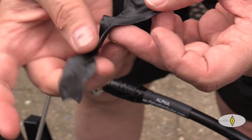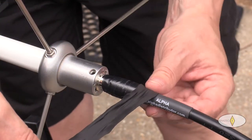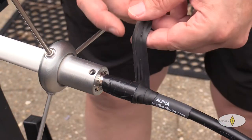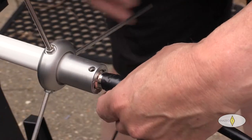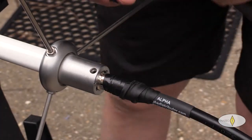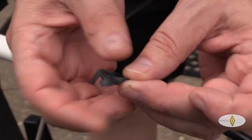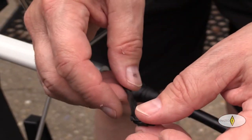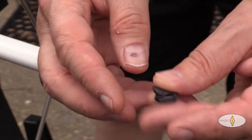Okay, now you want to start it at the base and wrap the coax seal around the pipe. And as you can see, it kind of stretched out of place a little bit, but that's okay. It's always moldable again. You can just stretch it back out. And if you need to, you can always get another section of coax seal, which I think I'll do.